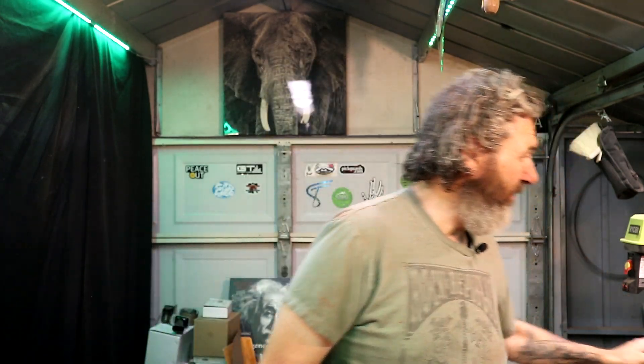I may turn this thing right here on its side and actually use this, or I could use my leveling beam, which may be a better idea. I'm close already, so I don't want to play around with taking a chance even with the hand plane. I don't want to take a chance on getting a bunch of chip out, especially on this strip down the middle of that fretboard. It's got some major curl in it, and I'd be concerned that the plane blade may not glide across that as easily as I think.